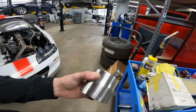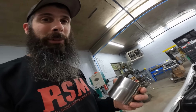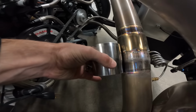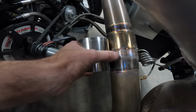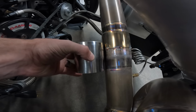This is part of a double slip. You can see I've taken it out right there. I want to show you how far this is coming apart just with the heat movement on this hot side. You can see the line where my thumb is. That's where this edge was. If you put that at the weld seam, that's how much engagement is in there right now. So basically that sucker was about to come apart.